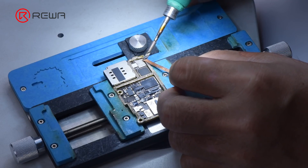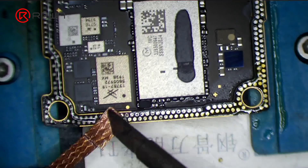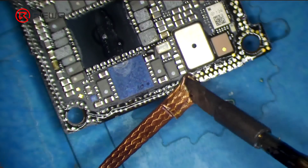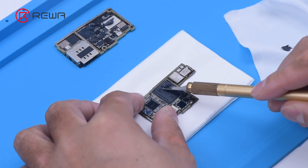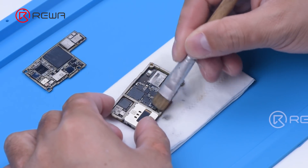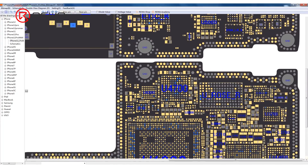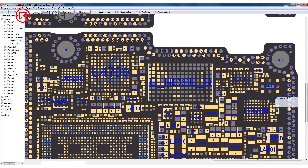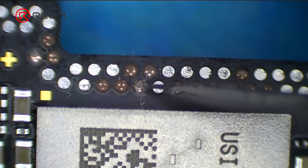Because there are still missing pads, we repair them. Clean tin on the bonding pads of the signal board with a soldering iron and solder wick, then clean the bonding pads of the logic board with the same method. Remove the thermal paste and keep cleaning the bonding pads with PCB cleaner. Open Refox bitmap to determine the missing pads for repair. Since some missing pads are grounded, there is no need to repair them. Scrape to show circuits of the other missing pads with a sculpture knife.